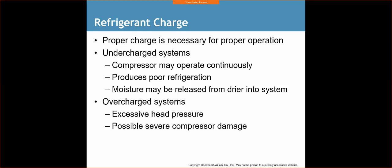You may have two identical buildings that are sitting right next to each other. One may have a big tree covering the top of it, and it has tons more insulation, new windows, and the other building may be sort of decrepit, falling apart, and you're going to have two different size loads. Even though they're the same building, you're going to have two different types of systems. So the only way of really doing it correctly is to do a Manual J. Depending on who you work for, they may want to do this, they may not. The governing bodies, they want you to do it every single time you do an equipment replacement, because we're going to put in the right size.